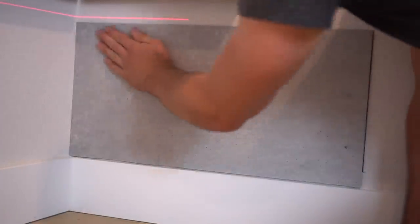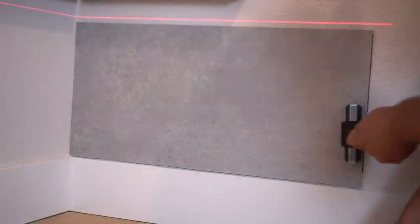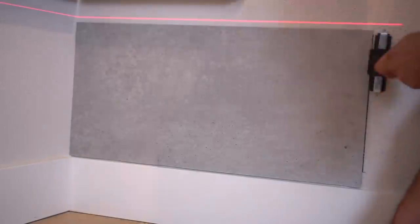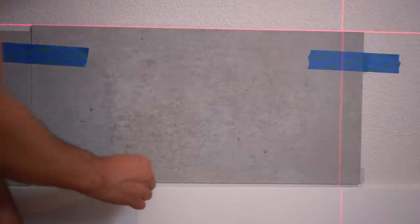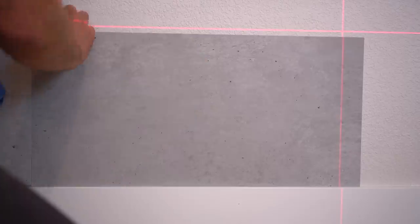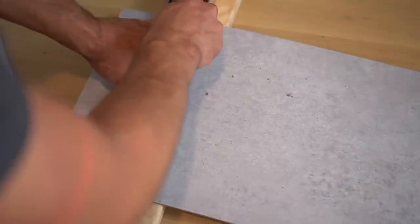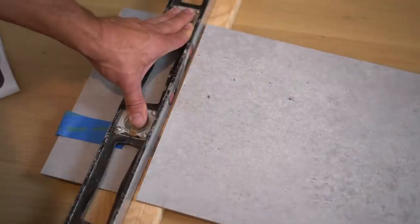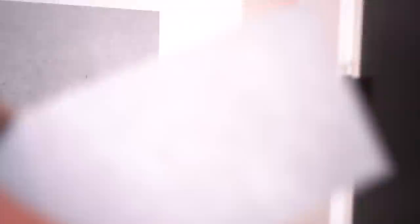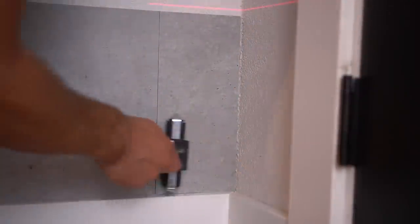When it says peel and stick, it really means peel and stick — that's all you need to do. Peel off that film, stick it in place, and I use a hard rubber roller specifically designed to apply even pressure on multiple types of surfaces. I grab my washer and Sharpie again, make a line across the panel, cut and place it. Just double-check your levelness from time to time, especially on this bottom row, because everything works off of it. For cutting, you can even use scissors, but I suggest a standard utility knife — it provides a nice crisp line and lets you use a level as a guide for a perfect cut all the way across.